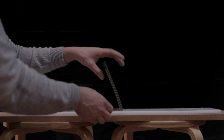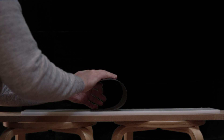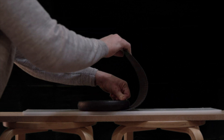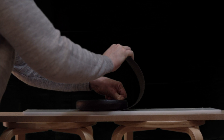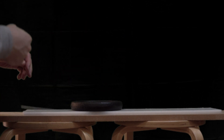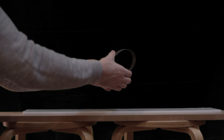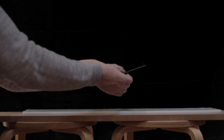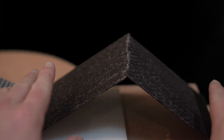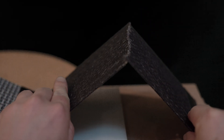The Innegra hybrid weave ends its battle differently. I can hear the carbon slowly cracking, and the resin too, which flexes less than Innegra. It fails gently, and the 50% Innegra still holds the part together with a little — if not a lot — of strength. It would be very hard to part the two halves. Finally, the unidirectional: as carbon is famously brittle and it's so thin, you might expect this to snap like a wafer. Not so — all of the fibers are directly resisting the bending force. I simply couldn't snap this pure carbon sheet and had to show how weak it is in the perpendicular plane instead.